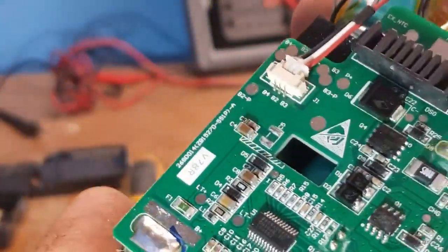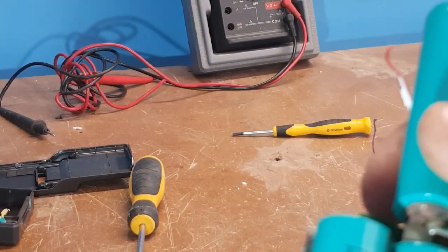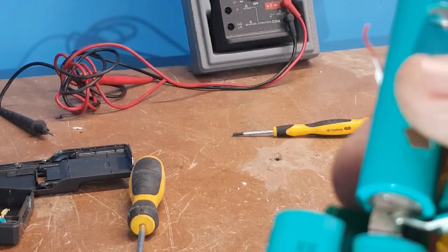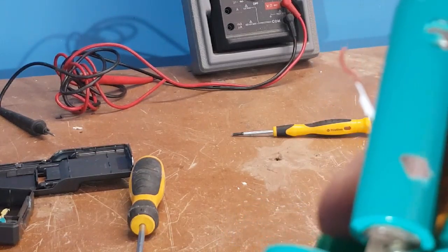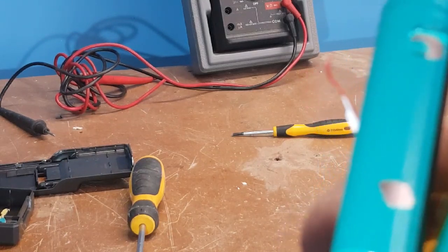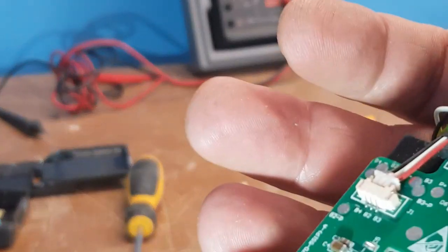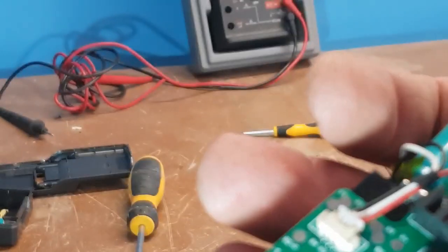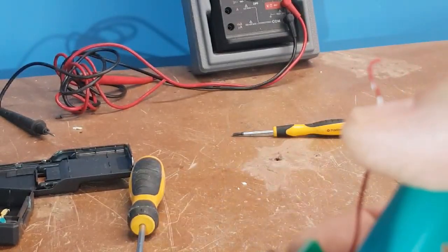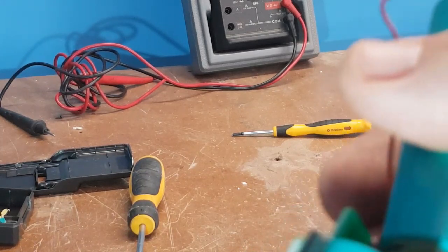Having a look, because there are only five batteries on here — those two batteries are going to make 8.4 volts, another two make 8.4 volts, and at the lowest they're going to be under 8 volts. Then you've got a spare battery to make up the 18 volts, because these packs are 18 volts. They're a bit cheap and nasty — I don't know why they didn't put another battery in.